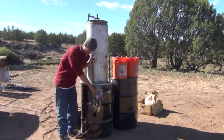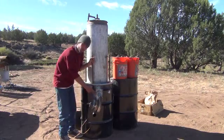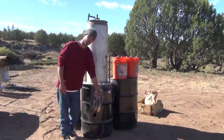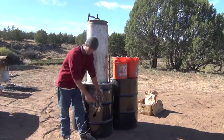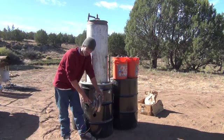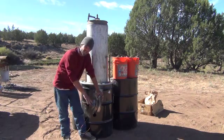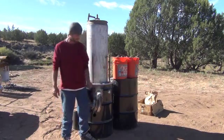You saw me put the top on. The last thing I had left was to extend this pipe or to weld a coupler on the barrel so I could put a two inch pipe off of this. The next part I've got here is a heat exchanger fan. This heat exchanger fan comes from an RV propane powered heater. It's a dual fan and it's got an external motor, which is definitely going to be better to use. Typically you wouldn't use it this close to the reactor because I'm going to get drippage out of here from the bio crude oil that it's creating. So you'd want to put this after most of your filter system, but just to show you how to do this, I'm going to use it right here.